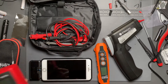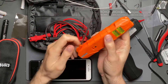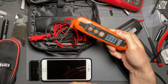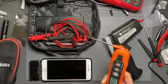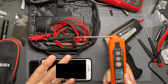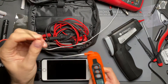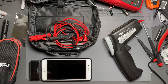The next thing is a temperature probe, like what's attached to this Klein IR07, which I typically use for air temperature measurements and some liquid measurements as well. It uses similar technology to a thermocouple, but it's put into a probe with very high thermal connectivity. You can use it to get precise measurements in air or liquid — or even in a solid like a potting compound. These are great when you can get directly to the thing you want to measure, but there are many situations where you can't, or where you don't want to spend time wiring up a bunch of thermocouples just to get a temperature reading.